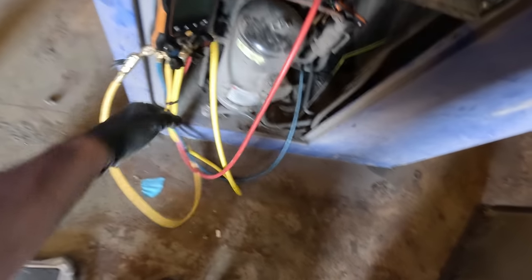Them drains seem to be working. Let's squirt about six ounces in there to make up for what's on the ground — might as well just do it right while we're here. We're going to hook right onto the suction line and pump it in. Liquid ounces versus weight ounces is different — it's so close I just use the weight ounces. I reweigh it and see how much I used — I know each pump is right around an ounce. Should be good. Definitely better than not doing anything, which is generally what would have probably happened.